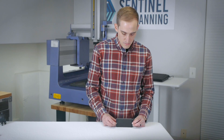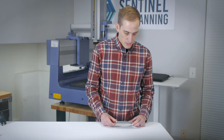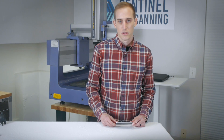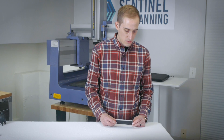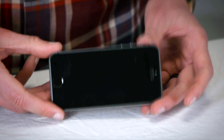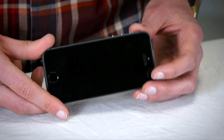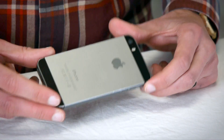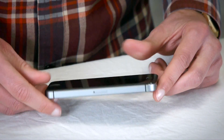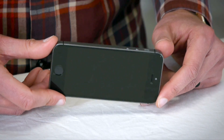For something like this, you're not going to be able to use hand tools — maybe for the step heights you could, but for the gaps you're probably going to need an integrated solution that uses a chromatic confocal line sensor or a blue line laser, with software that sets up an algorithm to decide where that gap or step is and how it should be measured. Maybe mounted on a six-axis robot. You could use an OMM to measure the concentricity of the lenses, but a lot of it will probably be a custom solution.